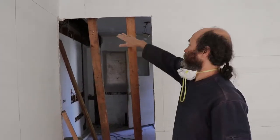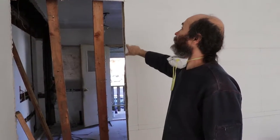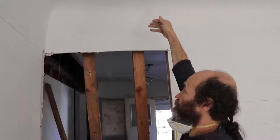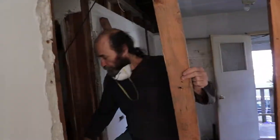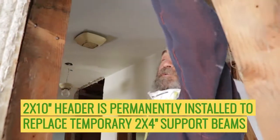Yeah, we measure and we cut out the side of the opening that we want in here. And we didn't go all the way for the seal because we don't want to remove all the curves, we just want to leave it. This is a bearing wall, so we need to put a header to support it.